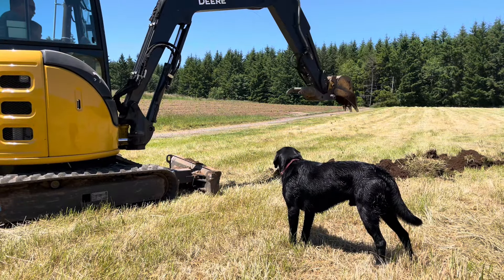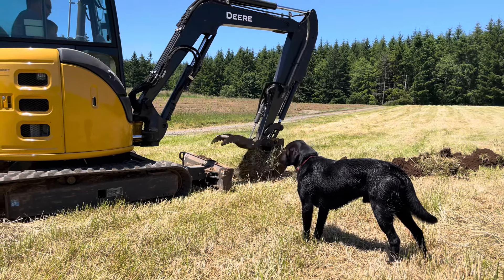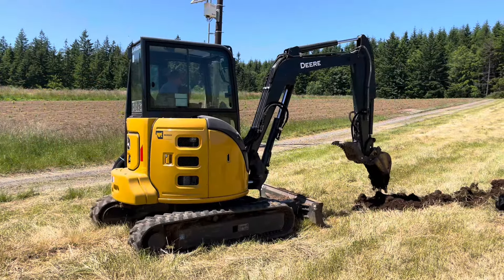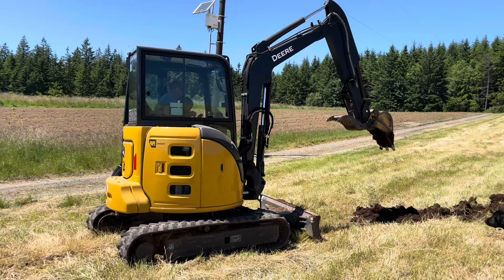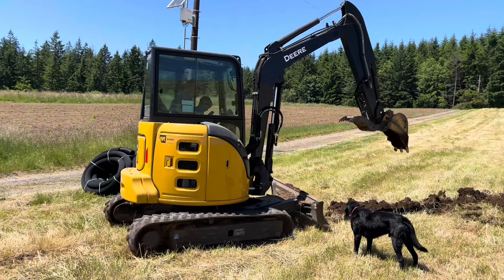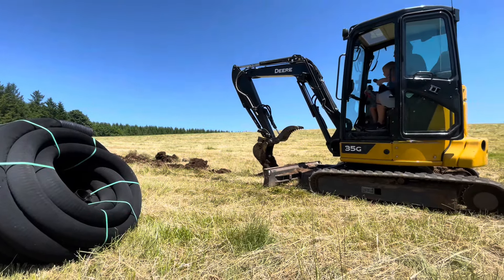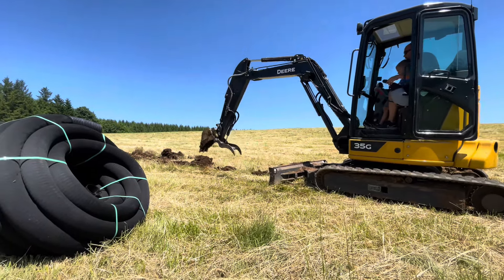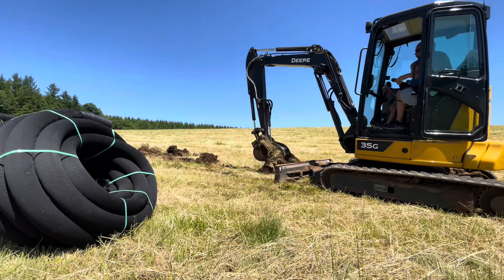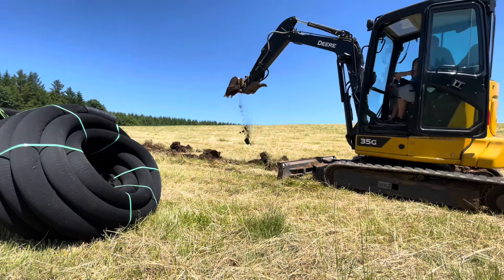You can tell I'm not super great on this excavator — I only have probably about 15 hours of run time total on an excavator. I was having issues because the ground was so wet, I kept plugging up my dig bucket, so I kept having to bang it around, get the dirt out, and just keep working at it, but I got better and better as I went. You can see in these videos, especially right here, my little blade coming down — I kind of pick up the front end. That really stabilizes the excavator when you're digging and you don't get so much rocking. So that's why I back up, drop that blade down, get a little bit of weight on the front end, and start digging again.